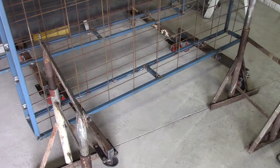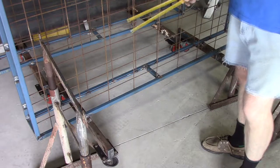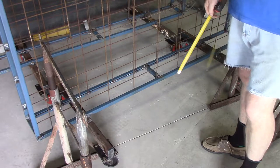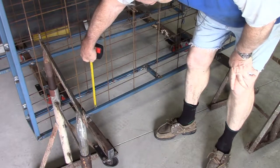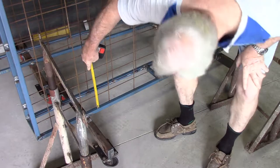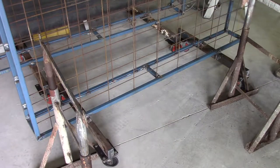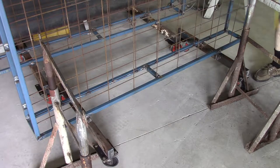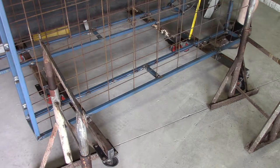We're ready to put the small mesh around the bottom, and that's to contain the ballast stones to give it some weight down the bottom so it doesn't tip over. The plans give a rough idea of how this should go, but it's very dependent on the size of the large mesh that you use and also on the positioning. The plans are only a guideline — we need to measure what we're doing. We go from the top of the bottom SHS to the top of whatever mesh row we're going to use, and in this case we're looking at about 275mm. We'll go to the middle of that row. Check it at both ends — we're spot on, 275 all the way. The other side is about 277, so it's not too bad.